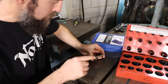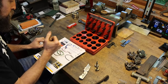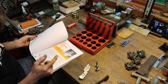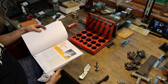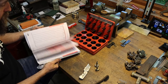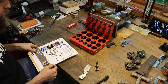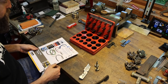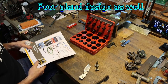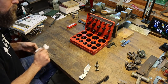Let's cut off these O-rings and replace them so they don't leak. Anytime I have questions about O-rings, I refer to this O-ring handbook by Parker. This thing covers almost everything you could imagine. O-rings are an extremely deep subject if you want to dig into the weeds — how to make them work to their peak, how to avoid failures. Most failures are due to improper selection of materials or improper installation. That's a great book — see if you can pick one up.